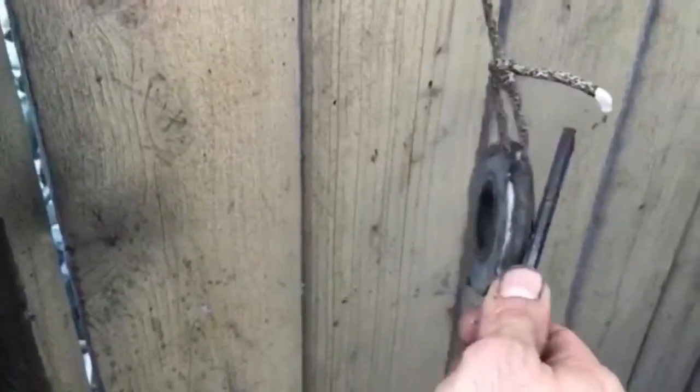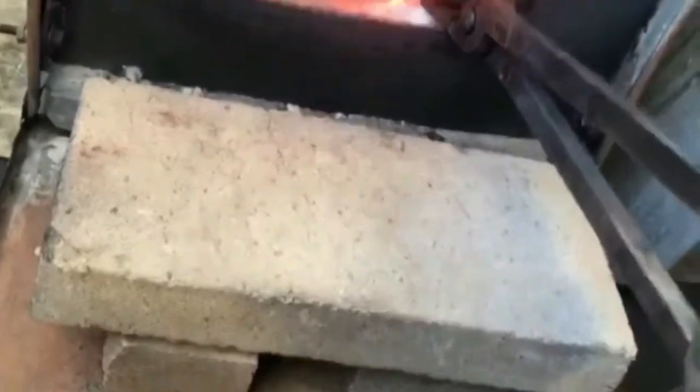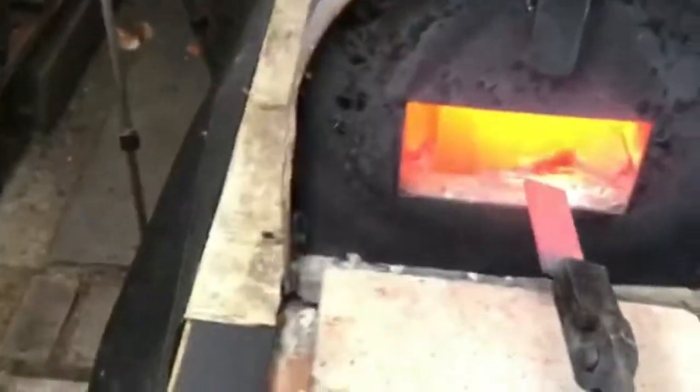I got the question about why I hang the magnet like this. Here's the reason: if I have steel, this magnet is powerful enough to attach to it, but if it's non-magnetic, it doesn't. So that's why I hang it. We're testing one now — it's at the non-magnetic point. We're going for the oil quench — non-magnetic, going in.